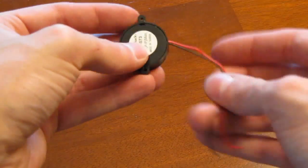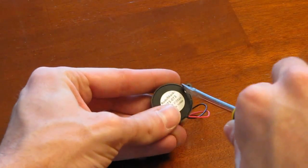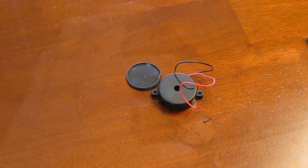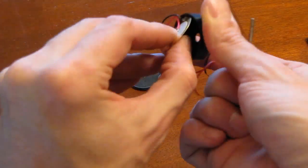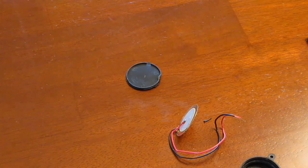First take your piezo and unravel the wire from the casing. Get your flathead screwdriver and put the end into the small slot on the edge of the casing. Pry the casing open but make sure not to dent the piezo. Now use one of the machine screws and pop the piezo out of its slot — this should be fairly easy to do. Remove the piezo from the casing and go find a 1/4 inch mono jack or XLR jack depending on what your drum machine accepts.